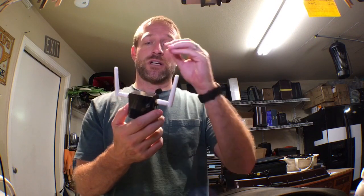The key thing is wireless requires antennas. If you're a ham radio operator, you know that the antenna is really everything. You can have all the power in the world, but if you have a bad antenna, it's not going to work. You can have a very small radio, but if you have a good antenna, you make the most of the signal. The antenna is what converts electrical energy into RF energy — that conversion between on a wire and through the air — and that is really the most important thing.